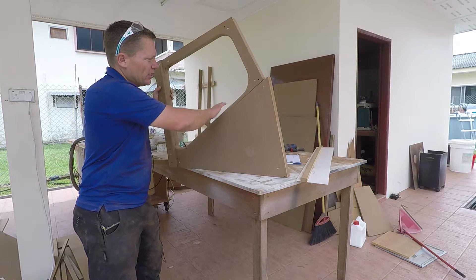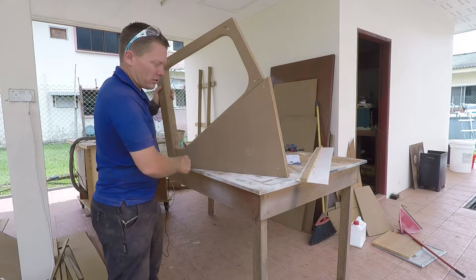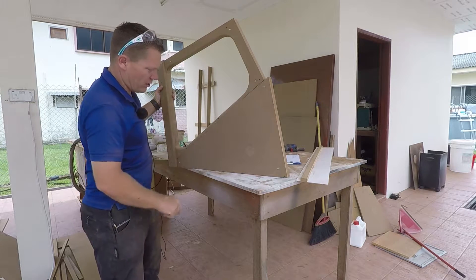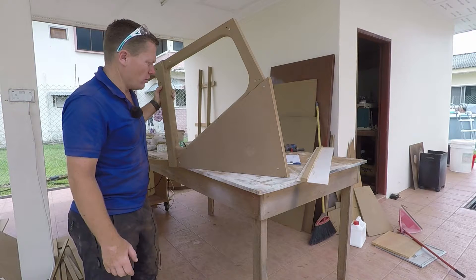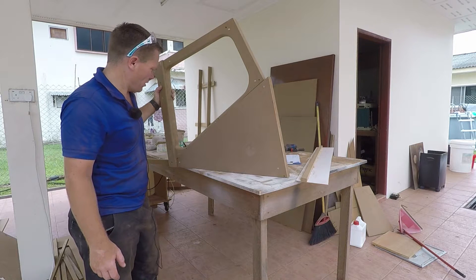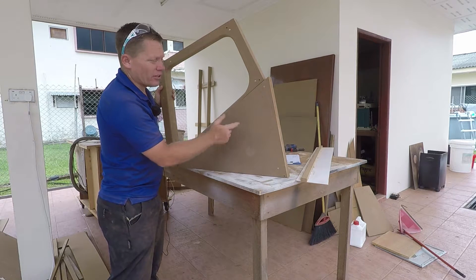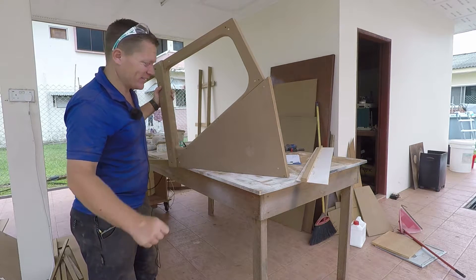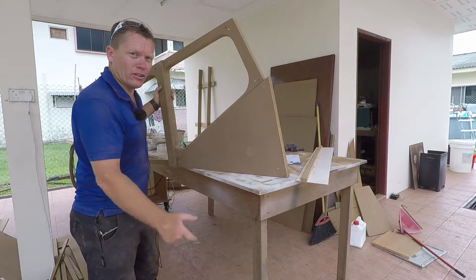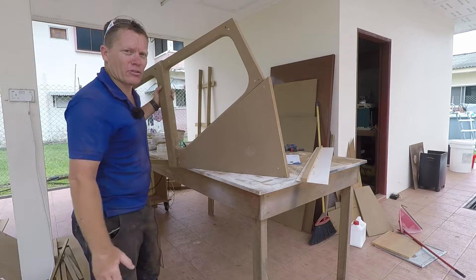As you can see, here's the base on and here's the window frame. Now there is a slight gap where I haven't gone completely straight with the circular saw — it's about a millimetre here, about half a millimetre here. So a bit of fine tuning, a gentle plane perhaps on the inboard face just to get that a bit better. But overall I think that'll look quite good. There's a hole that goes in here which has a light in it — I'll let the CNC cut that, at least that'll be exact. Onto the next part — let's get the sill on so I can fold it all together and give it a bit of strength, and that'll give me the correct angles I need as well.